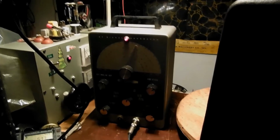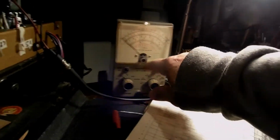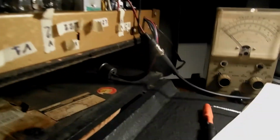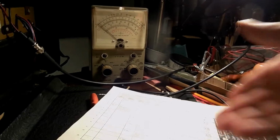Dare put you through steps 2 through whatever. There's a whole bunch, but that was step 1. So the signal generator set to the frequency, and then you monitor the AC voltage coming out of the voice coil, and you adjust your tuning slugs so that you get the maximum deflection, and you go all the way down the list.